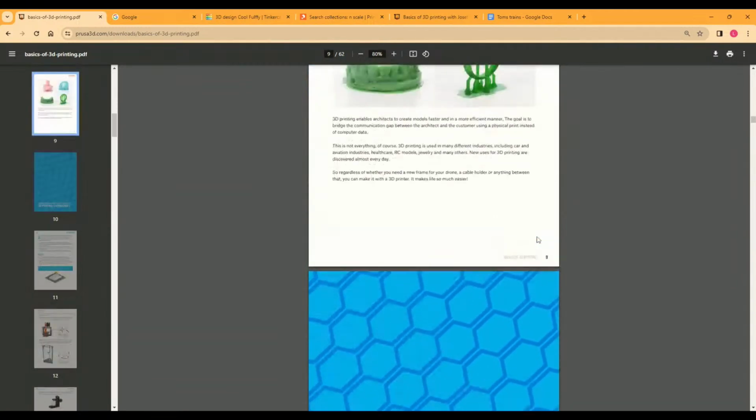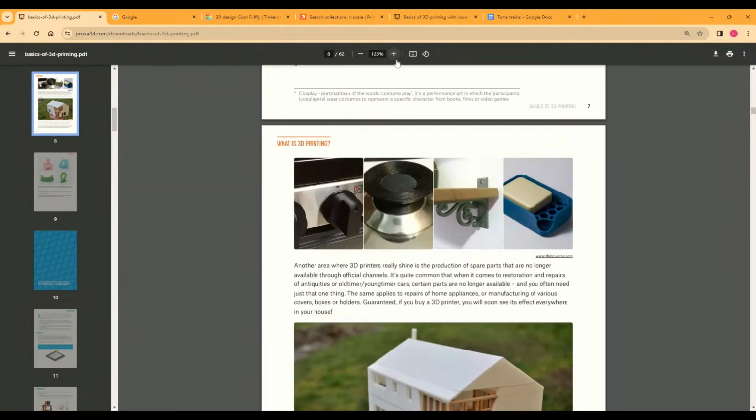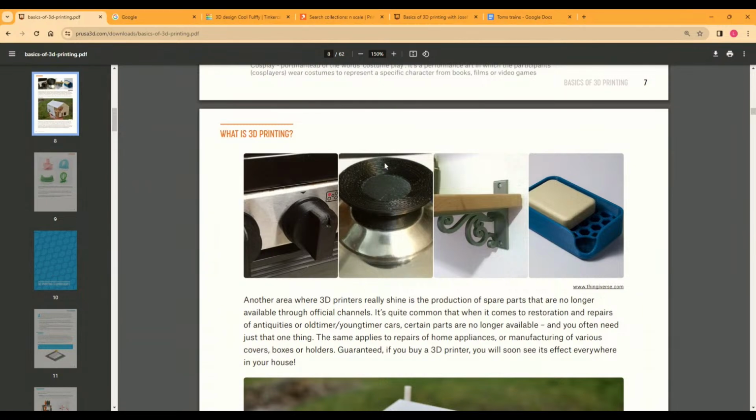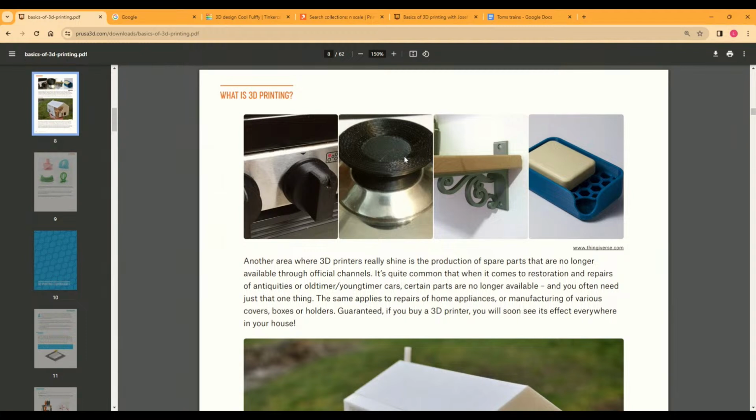And then if you want to look at some of the prints, there's some demos here. This is an FDM model. So you can see on these, you'll have a little bit of layer lines. And so some people don't like the layer lines, but there's something called post-processing, which is basically you can sand and paint or fill and make all this go away. It's a little extra work, but usually for larger models, the FDM, let's say the different scales that you guys are printing at, I'd say HO plus, anything bigger than HO, you probably want to go with this process.